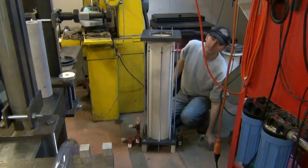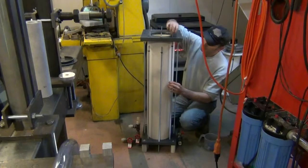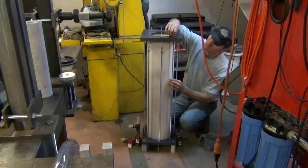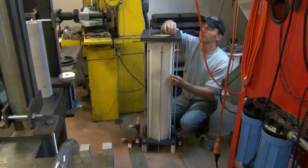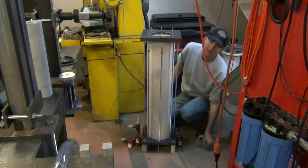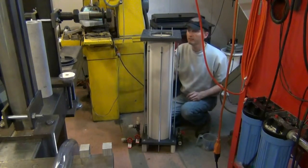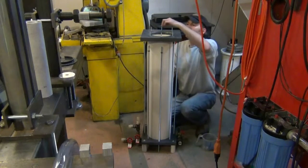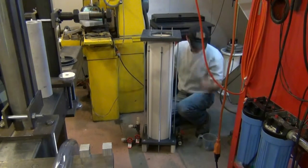This top plate needs to be able to withstand over a ton of pressure at its rating. So there's a lot of stress on this plastic, so I chose 8 rods, not because 4 rods can't stand that kind of pressure, but plastic itself starts to bend under those pressures, so I had to fortify it.